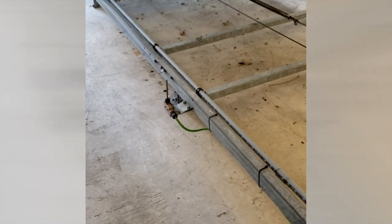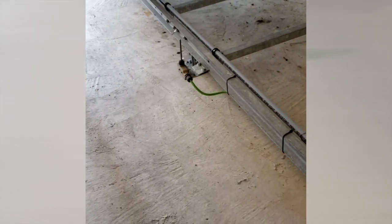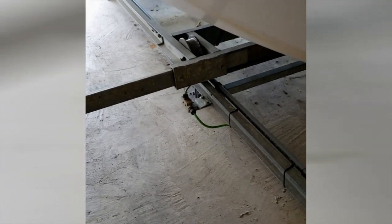Okay, here comes the boat — half of it is in the boathouse now. I'm going to let it go all the way up to the upper limit switch, this wobble stick, and show you how that works. Big difference between the upper and lower limit switch: the lower one needs to be waterproof, this one does not, and this switch is in fact not waterproof. You can see that front panel of the dolly heading right for the wobble stick — boom, pushes the wobble stick, shuts the motor right off.